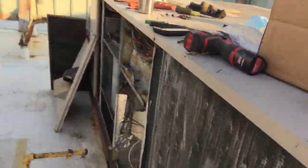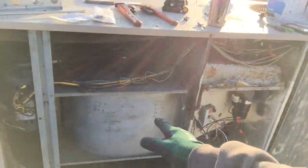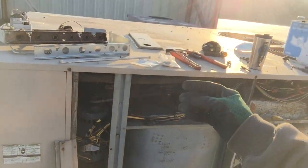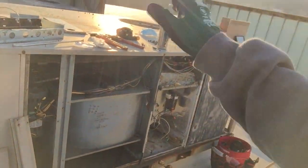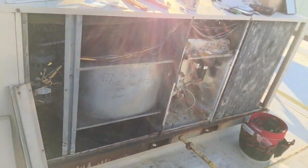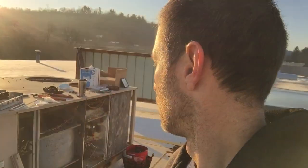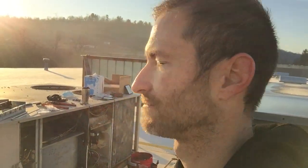The leftover combustion gases exhaust out. In this particular unit, the fan always runs, blowing heat into the space. After the call for heat is done, the thermostat shuts off, the burners drop out, the heat exchanger cools down, and then the fan eventually shuts off — though in this case the fan always runs. Wish me luck, stay safe, hope you learned a little bit from that — HVAC explained!